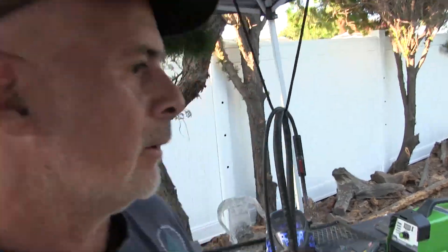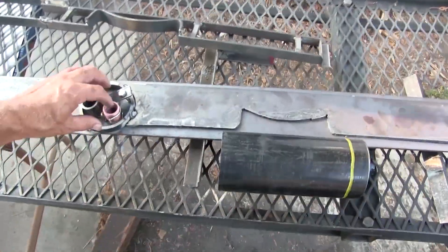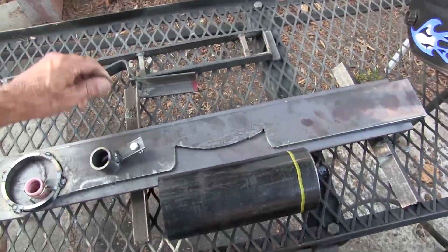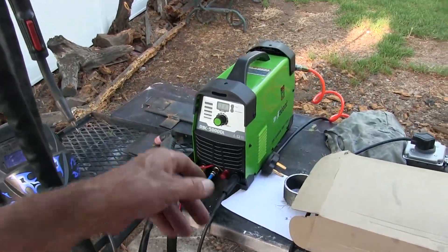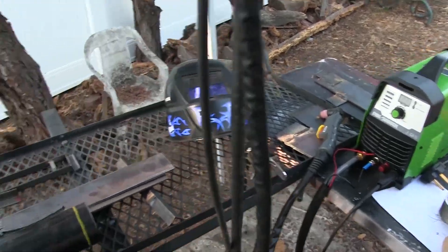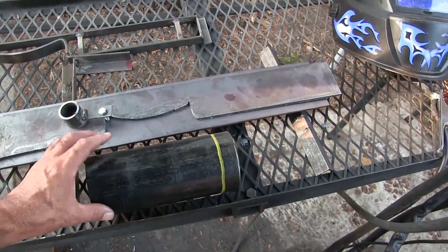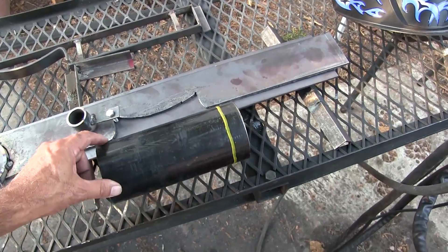That's it for today — back to the drawing board. I would have liked to start punching this stuff out, but I got my circle and my jig. I'm cutting a little better now — I turned the plasma cutter up to 45 amps. I guess I could take it up to 50 and see if it blows a circuit breaker. I'm gonna have to buy some more pipe — I'll see what the pipe is at Patent Steel.